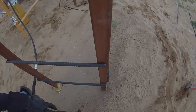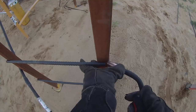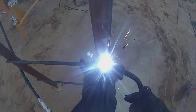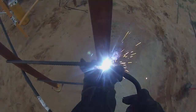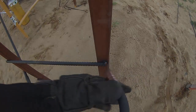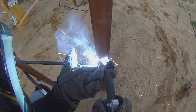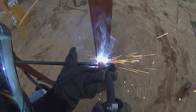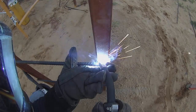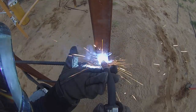Let's slow it down for a moment. These are bars that I just quick tack welded to the bar on one end, just so I didn't have to hold them anymore. Then with one hand I press the rebar against the tube and make a nice simple weld. That buzzing sound is also a good sign that the weld is going nicely. First I just tack the second end of the tube, then I go back and make a series of small loops that melt the rebar into the tube steel so they become one continuous piece of metal.